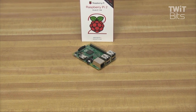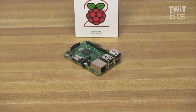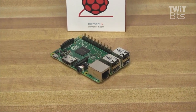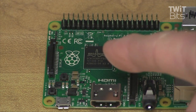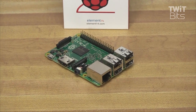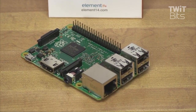The Raspberry Pi 2 Model B is a second-generation Raspberry Pi, replacing the original Raspberry Pi 1 Model B and B+. It still retails for just $35. Compared to the Raspberry Pi 1, it's got a 900 MHz quad-core ARM version 7 Cortex-A7 CPU and 1 GB of RAM. The upgrade in the CPU means you'll see approximately 2 times performance increase just because of the processor upgrade alone.